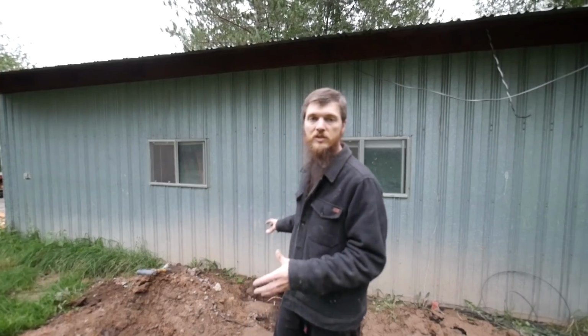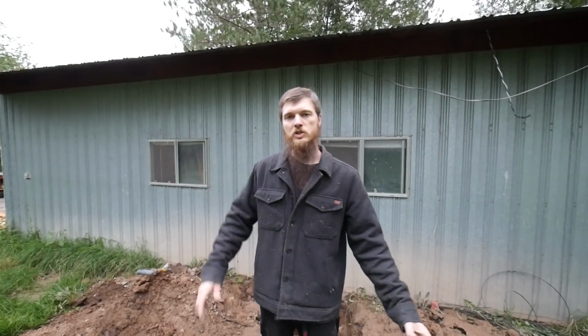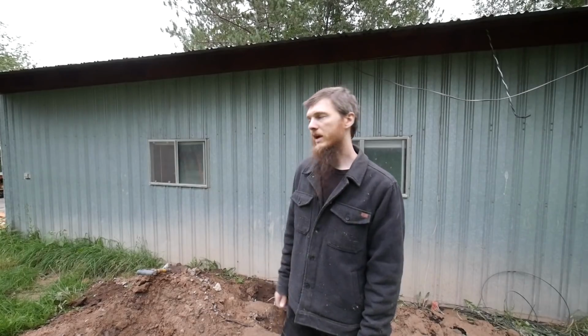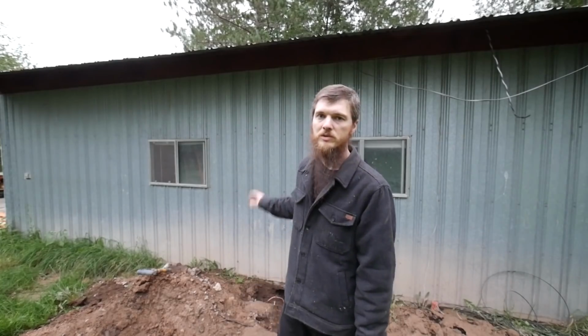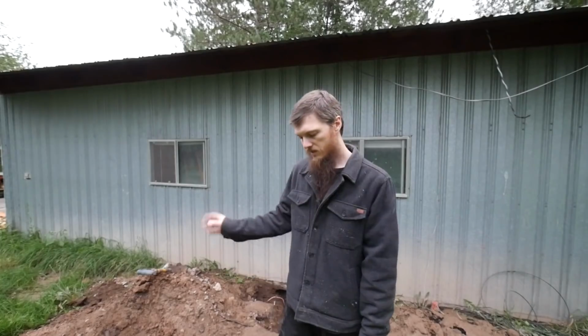Since we have an existing 3-wire service here, I'm going to go ahead and keep it and make it work. And it's no problem. I'm not showing anybody how to do stuff. I'm not trying to show you how to wire. I'm just showing you what I'm doing, and I feel totally safe and comfortable with the system we have in place for now. And if in the future the service needs to be upgraded, it's actually not that hard to do. It's just not something I'm wanting to do right now, but we won't have to redo too much to get it switched over to a true 4-wire service.